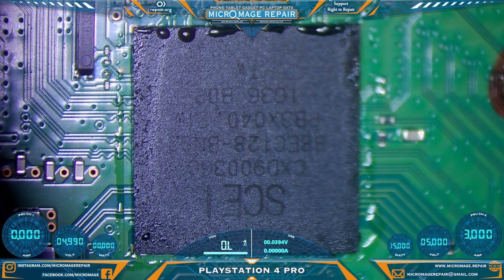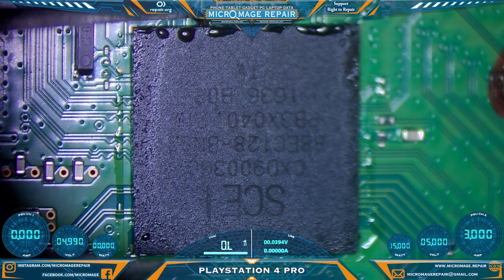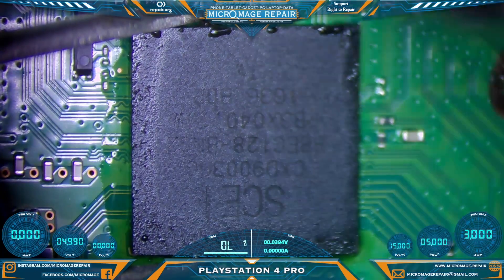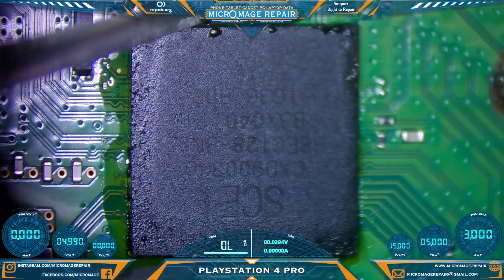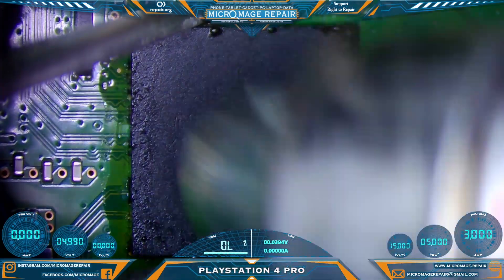This is largely experimental — I have not actually done one of these with the preheater before. So we're going to try starting at 380 degrees and if we have to make adjustments we will. I'm going to pop it up to 450 because I want this chip to come off fairly quickly. Going up to 480 because I'm not getting the results here.